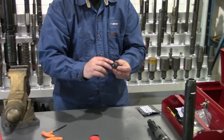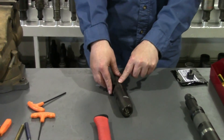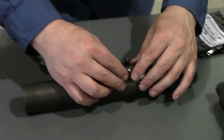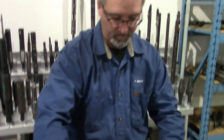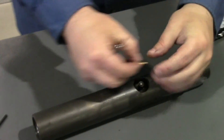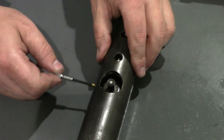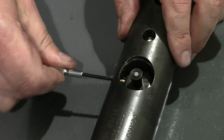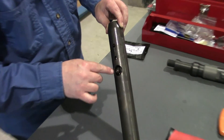Put a little grease on the O-ring and install that into the body. Face the body with the shear pin screw hole facing you, then line the shear pin screw hole on the piston with that hole. Line them up so when you put it in, it fits, and that should push down to the bottom so it's sitting below the body and not sticking out. Take our shear screw and install it into the body. It's a brass shear screw so it doesn't need to be super torqued, or else you'll have issues getting it out. It's just designed to hold the piston in place while it runs in the hole and shears off. Once it's in there, feel it bottom out and stop.